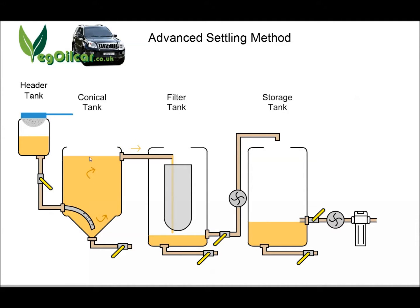As the dirty oil comes in, all the nice clean stuff at the top is being pushed out into the filter tank. My logic is that by the time it's been settled, it's already beautifully clean. Settling is a marvellous system. If you do this gradually — over a period of hours — and do batches, like I do: roughly 60–70 litres every fortnight, done over three or four days, there's always resting going on and oil is always able to settle naturally. As the oil settles, it cleans. Once it's settled, it's clean.